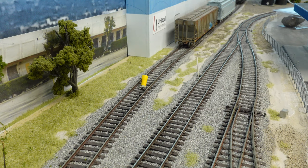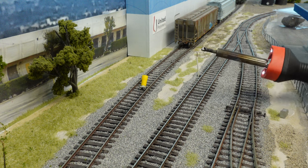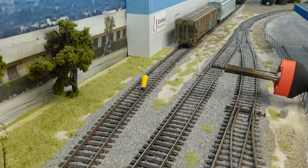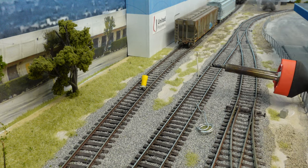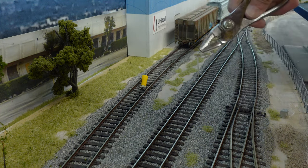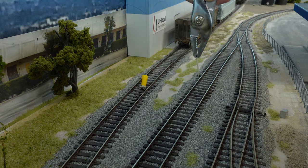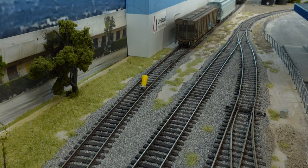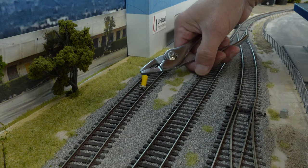We've scraped it up back there. Track power is off — making sure I'm not melting anything with my soldering iron. I know this is like the el-cheapo soldering iron. I'm going to let that warm up a little bit, get the solder ready. I'm going to let it warm up for a minute or two, then get this sucker on and hopefully finally be done with this little section of track that's been causing me trouble for the longest time. The soldering iron is pretty much heated up, but my little hook here is facing the wrong way, so I'm going to rotate it around. I want the hook to kind of hook onto the rail.